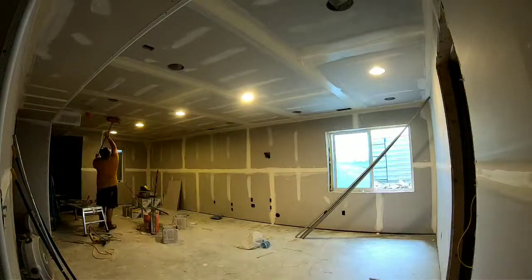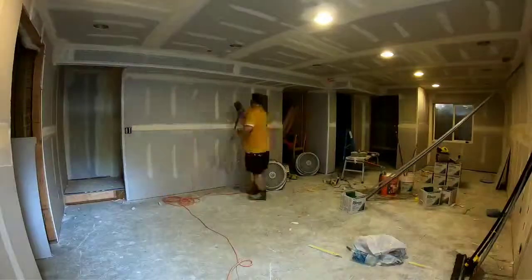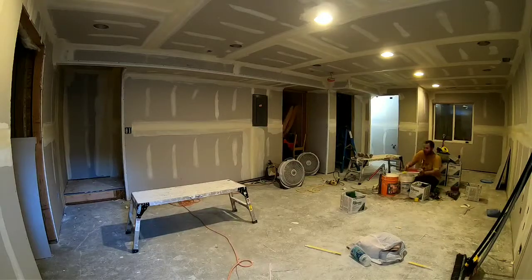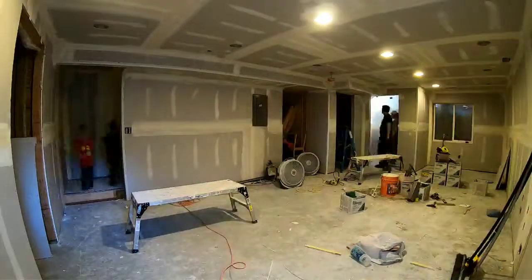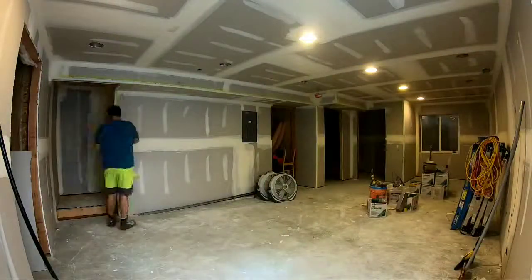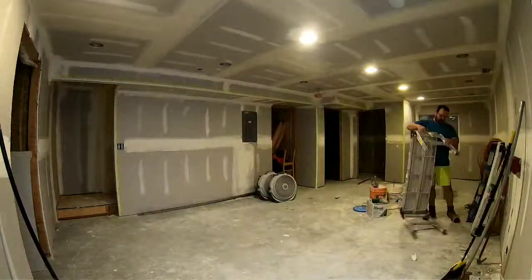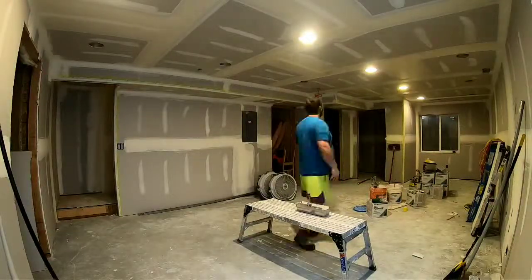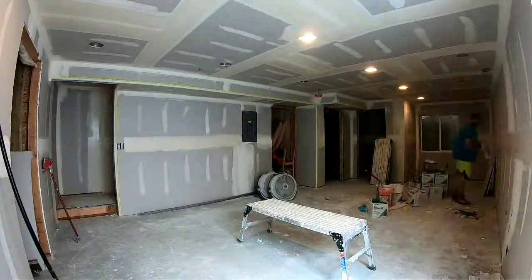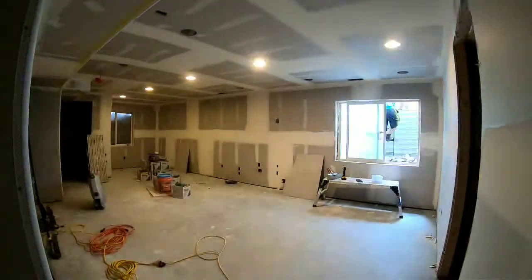Right after tape you can move immediately into the first finish coat, which is what I'm doing here with my mudding boxes. Don't stress out about having fancy tools like the mudding boxes and inside corner tools. You can certainly do all of this with hand tools — it'll really only add four to eight extra hours of work, which isn't that big of a deal since all these tools together are like two grand.